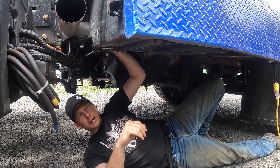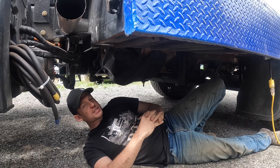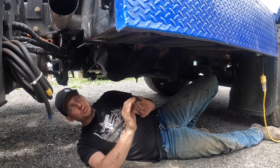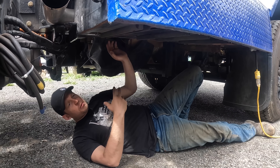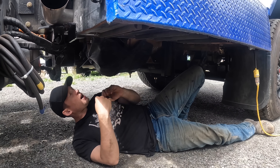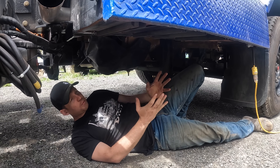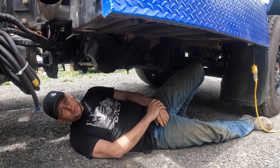I wouldn't run an old dirty straight pipe on this truck either. I love straight pipes, and I thought it would sound nice, but a generator runs at one constant RPM — around 1,750 RPM — which gets annoying fast. We ended up installing a muffler. Normally a truck sounds great because it's throaty and grabbing gears, but this just sounds like a screaming four-year-old — basically revving to 1,700 RPM with straight pipes and leaving it there. Wouldn't really recommend straight pipes on the diesel-electric version.